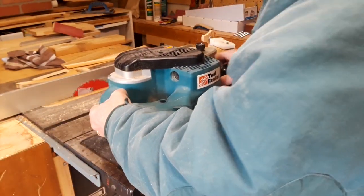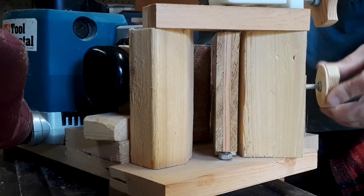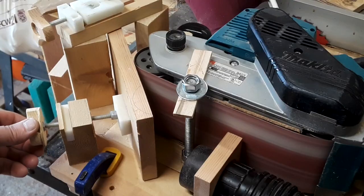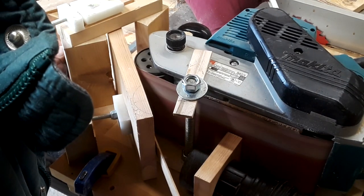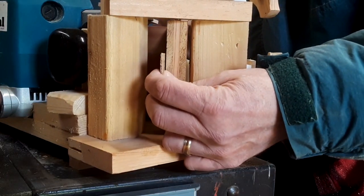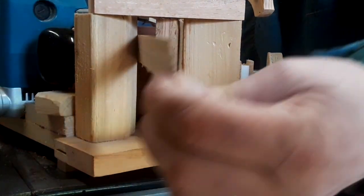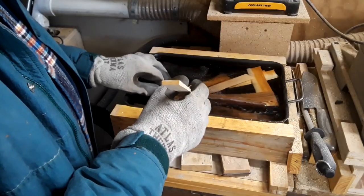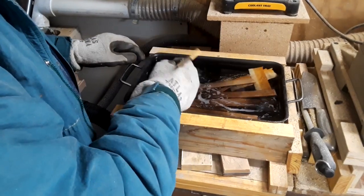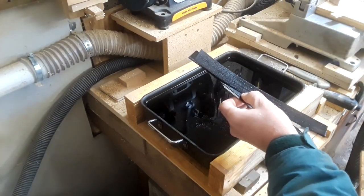Although this is just a humble cigar box ukulele, I'm taking the opportunity to build some luthier skills. This is a good opportunity to learn something about inlays, which I haven't done a lot of, so I'm making some veneers for that. The jig here holds the belt sander and allows me to make paper-thin veneers. By soaking the oak veneers in water and steel wool for about a week, they will ebonize — this is going to be for some inlays. Real ebony can be expensive, so I'm kind of stingy where I use it.